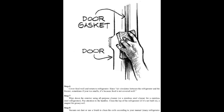If you plan to use two hangers, which is a good idea for wider frames that need extra stability, mark the points equidistant from the middle point to the edges of the frame. Step 4: turn painting over. Measure the distance from the top of the wire, pulled taut as if it's hanging, to the top of the frame. If you want to hang from two hooks, pull up from the wire at two equidistant points simultaneously and measure to the top of the frame.